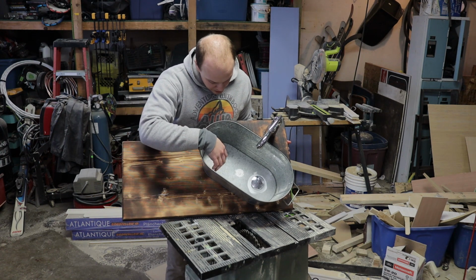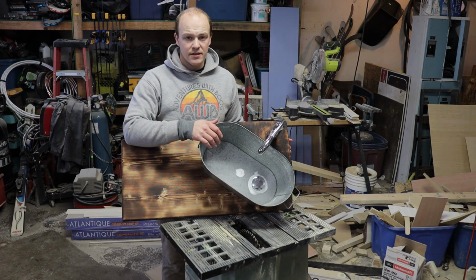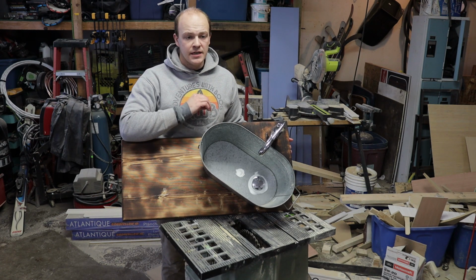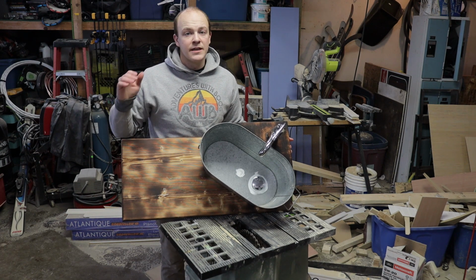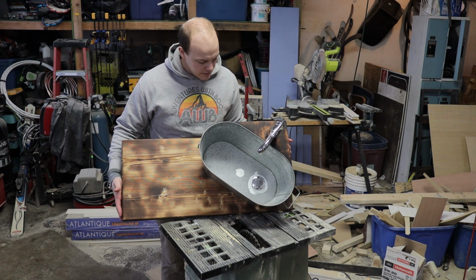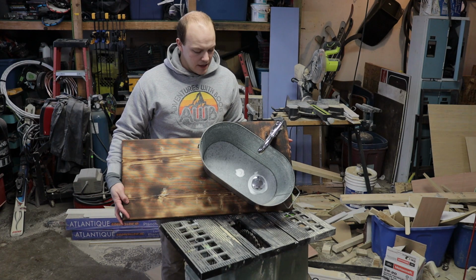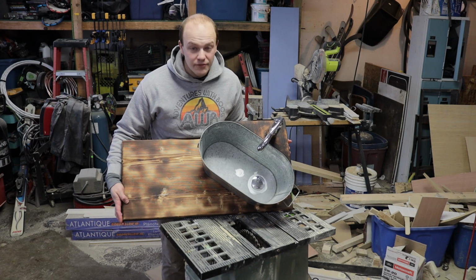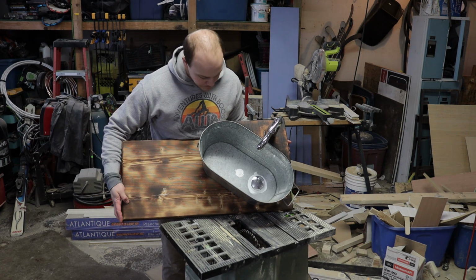Then what we'll do is this sealant that I use is polyurethane sealant. We've used that on other places on the bus. It's a very good sealant. It's completely waterproof, 100% waterproof, can be used underwater, and yeah, it's really good. The only problem is it takes 7 days to cure. So we're going to be waiting on this guy for a little bit until it's water ready.